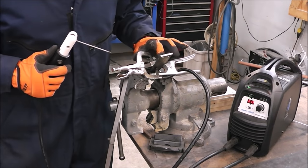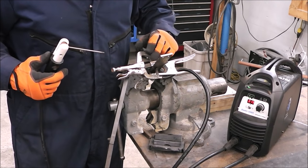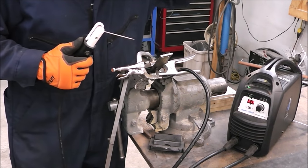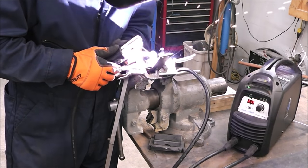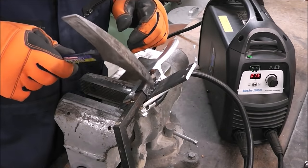So now I've got it turned up on end. I'm going to try to get creative now that I've got some weld metal built up that's bonded to the thinner part, and actually try to cap it without burning through. I don't know if I can, but the first pass worked, so hopefully the second will. So putting a cap pass on it was not necessary. It's just an experiment I wanted to try to see if I could put a layer over all my start and stop tacks.